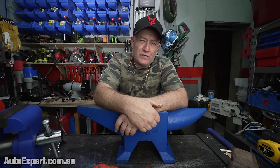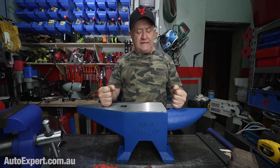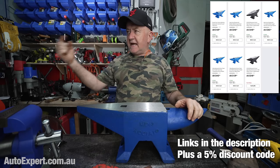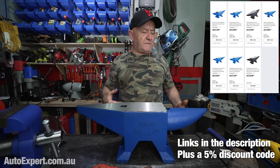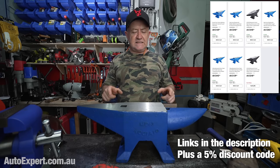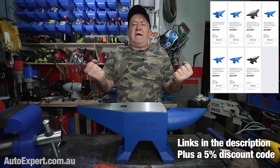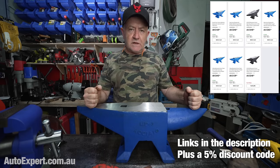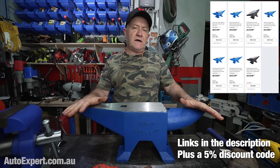And I'd suggest 30 kilos would be more than adequate for most people, half the size, really easy to move around. There was a bit of palaver moving this one in here because, A, the driveway is really steep, and then you got to get it in here. And although I'm not too bad at deadlifting 70, 80, 90 kilos, this isn't a deadlift, right? This is a box, and you've got to get it off the deck, and then you've got to half clean it up so you can get it onto the table. And if you drop it on your foot, that's going to be kind of memorable, even in safety boots. So you got to think smart about what size anvil you want.